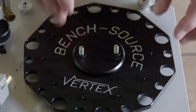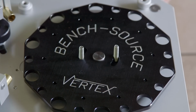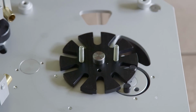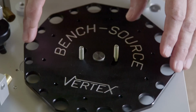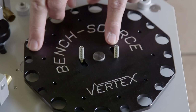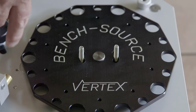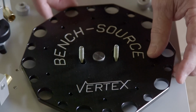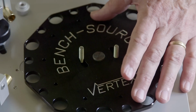They're just well made, just indicative of everything else. You got these little washers here. All right, move that aside for a moment. This plate sits on top of the Geneva wheel, as it is known amongst engineering types. And it sits on there with these slots. So that allows you to line up either a small hole or a large hole over the spinner down here where the flame is. Furthermore, you can fine-tune its location so as to take out the wobble in the cartridge, and I'll show you that in just a moment.